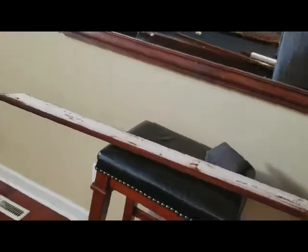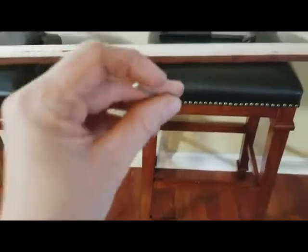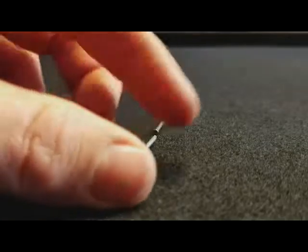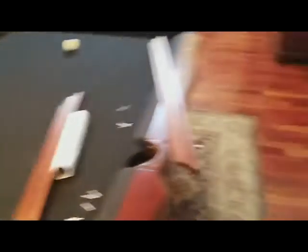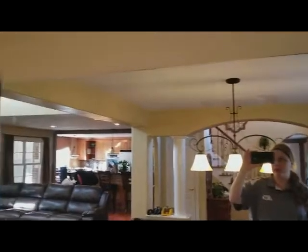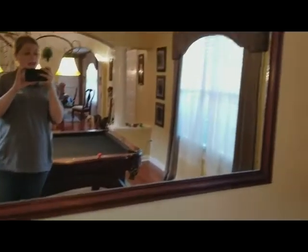One helpful technique: when you're hammering and you get close to the wood, rather than hammer all the way into the wood, you can take one nail and tap the first nail in with a second nail, using the hammer gently — that drives it in without putting the hammer face directly against the wood, keeping the wood nice. Next, the sides: I got the two side pieces up but only nailed at the bottom so the top can move slightly to adjust when I put the top brace on. Now for the final piece — the top — this is where I'll find out if it all came together or if I have to remake some cuts.